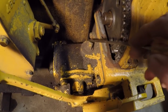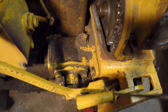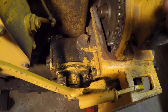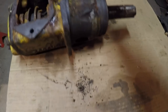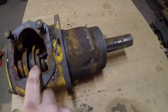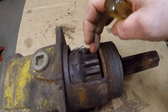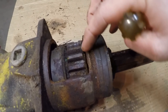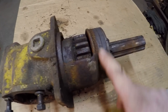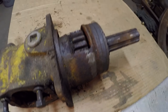What happens is after they've taken the bolts out holding the drive unit to the bell housing, they start prying and get maybe a quarter inch of separation, then it stops. They fight with it, get an even bigger pry bar, and that's when things break. I've got another drive unit housing here as a prop — you can see where this one has been welded all around the nose cone. It broke there because the idler gear hadn't been disengaged from the clutch shell gear inside the pinion housing. When they pried hard, that idler gear stopped against the casting edge and they broke the nose cone right off. I've taken several of these out that were broken in this manner and then welded and repaired.